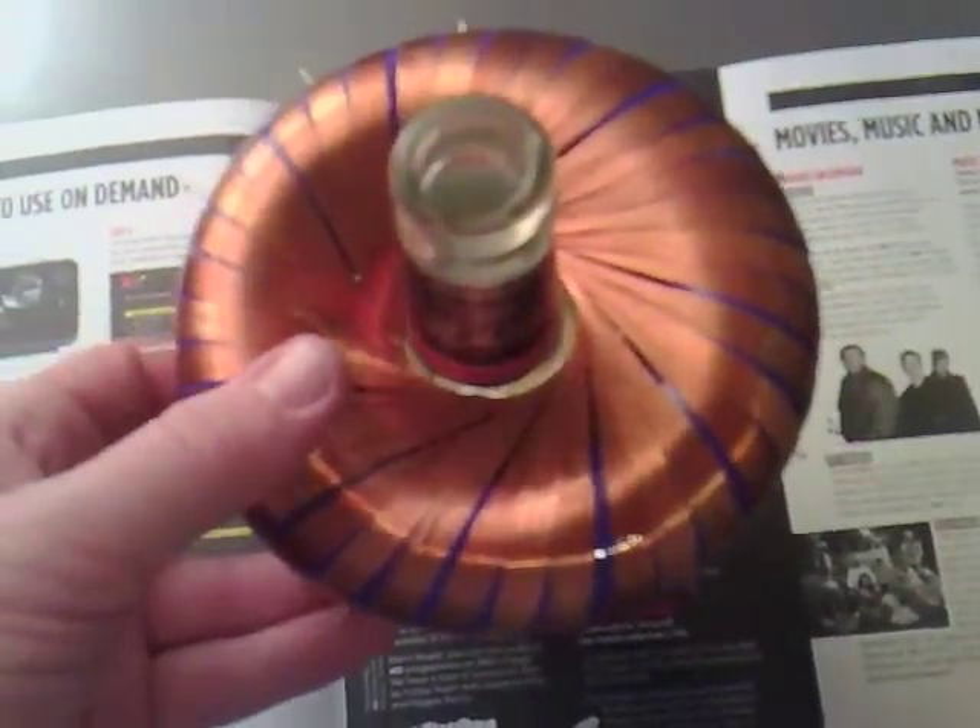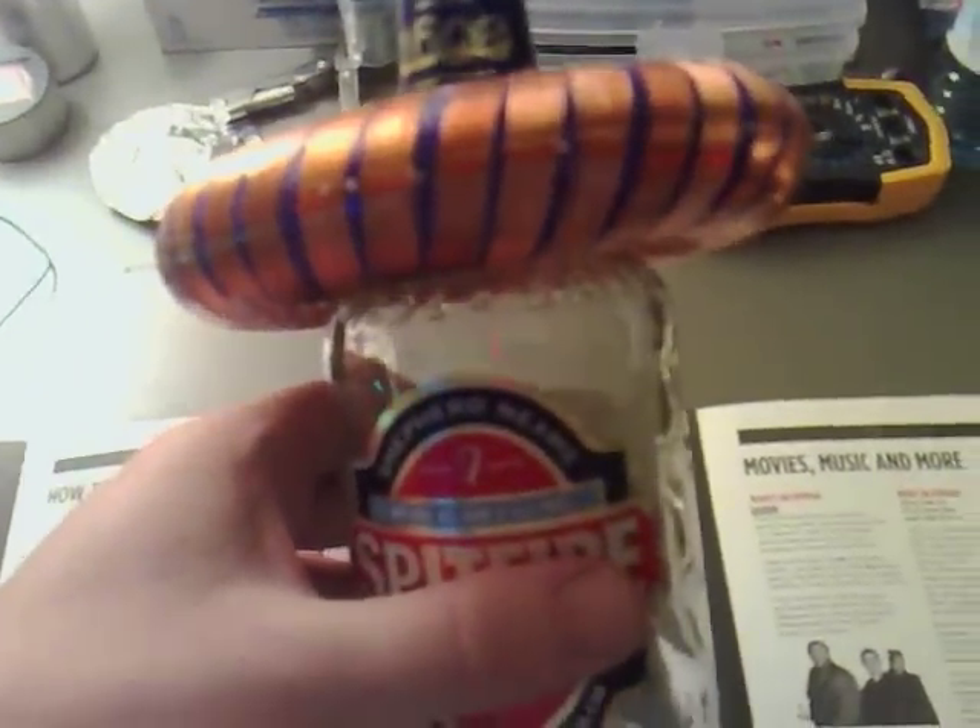What I've done is I've soldered the three coils on the way around, and I'm just going to place it over the top of this bottle now. What I'm going to do is lacquer that, and I can take the pins out, and then lacquer it again. Then all we have to do is — hopefully we should have a coil which is not going to come apart.